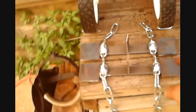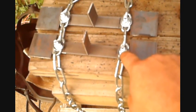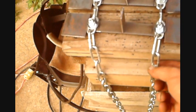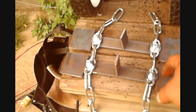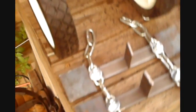I'm using the chain to attach the track plates, which are these parts right here, and I'm bolting them together so you will be able to service the tracks. That way if the chain ever wears out, you can unbolt all the track plates and replace the chain, or if a track messes up, you can unbolt the whole track plate and replace it with another one.